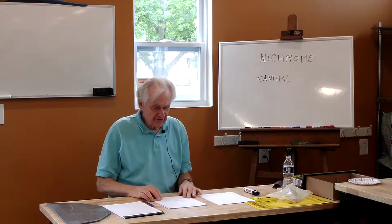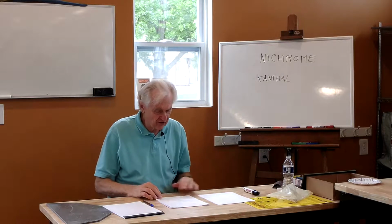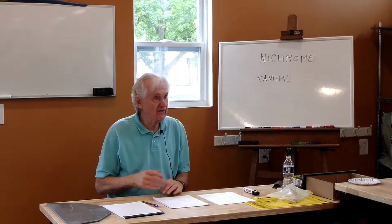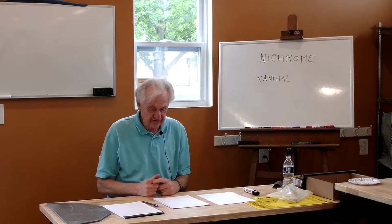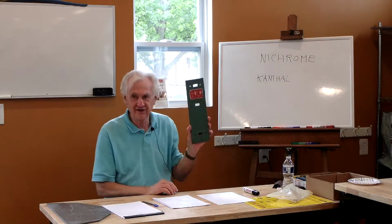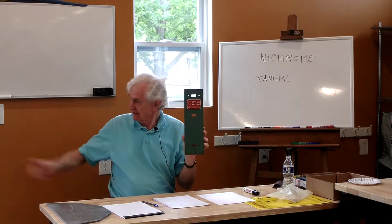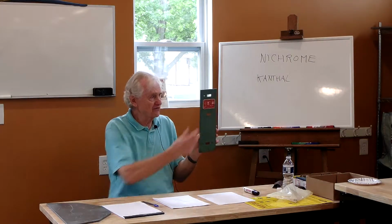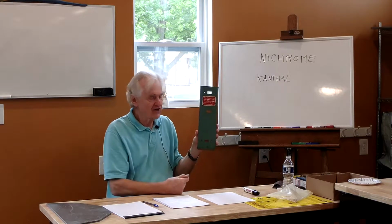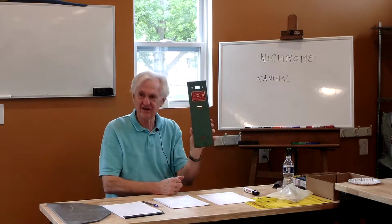So, first, we're continuing with the small studio kilns. There are two types of power control that we have commonly: manual and automatic. The manual is basically this, and this is what they had when they first started out with electric kilns. You basically had on-off switches. This is a control panel from a really old electric kiln. This is a Crest kiln, and if you notice, it looks like it had 3 wall switches in it. It had switches that just turned an element on and off. It had three different rings, and you could turn 1 on, or 2 on, or 3 on, and that was the full. This is the complicated control panel.